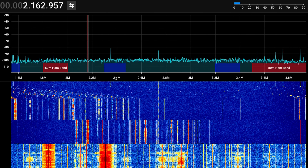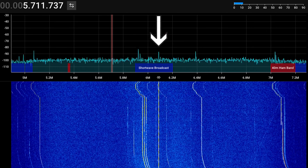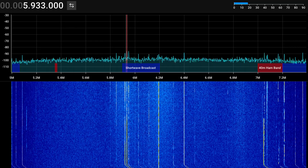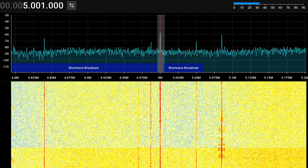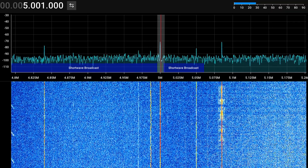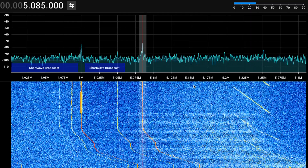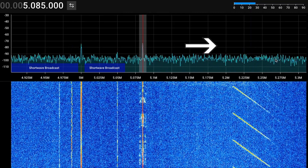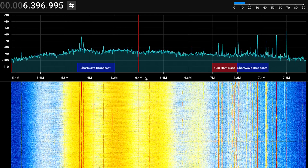I'm going to keep moving along. There's still some interference — some of these spikes just stay the same, so that's interference on my SDR's part. But here's stuff that's not from my SDR. This is actually a time station, and they have other frequencies that'll come in a little more clearly. Basically, your wall clocks and stuff can listen to this frequency and get accurate time info. So when the batteries die and you replace them, you don't have to set the clock — it can just know. Pretty cool. There's something else coming in — some weird frequency thing. There's so much noise; I think it's got to be from an LED light or something. I've tried turning off the lights in my house and nothing seems to make a difference.